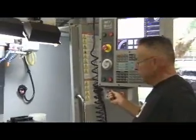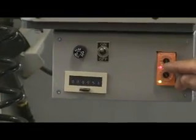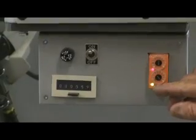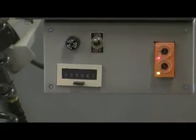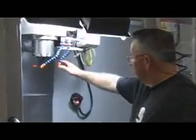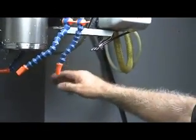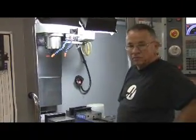The way this works, we're going to turn on our little unit over here. This unit has a counter on it and a timer. It tells you how long it goes between air blasts, and this tells you how long the air blast is — and both of these are fully adjustable. As you can see over here, it does put out a really big blast of air. So we're ready to start machining stuff now. We thank you for listening — take care.